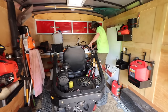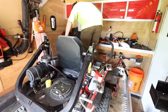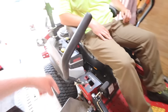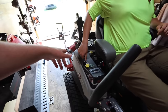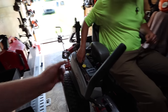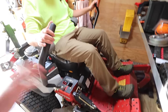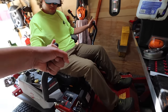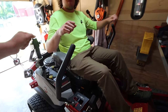And some of you guys that are just kind of getting your business started or want to learn how to use the zero turn, we're gonna show you a couple tips today. So, all right, first things first, Rob, you already know this, but just for review purposes. We've got the ignition, so when you start it, just hold it a quick second, then let it go. Yep. Parking brake. We got the parking brake, so you'll slam that down, pull those in, that's your neutral. Back is reverse, forward is forward. One forward, one back, you're gonna do a left turn, opposite the other way.